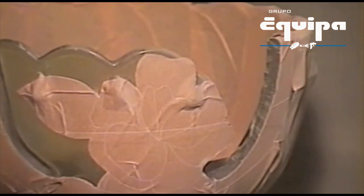You'll notice it's not going to take probably about half the time to cut because I have a lot more abrasive. Even though it's still a lean mixture, you're not going to see a lot of abrasive in the booth as I sandblast. We're still running about 50 pounds of pressure, so it's going to cut out pretty fast.